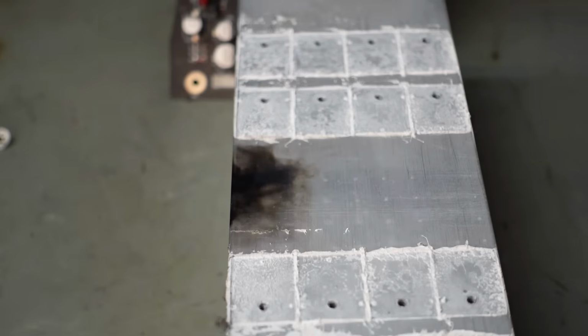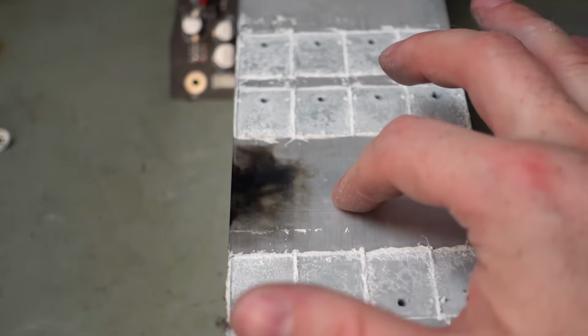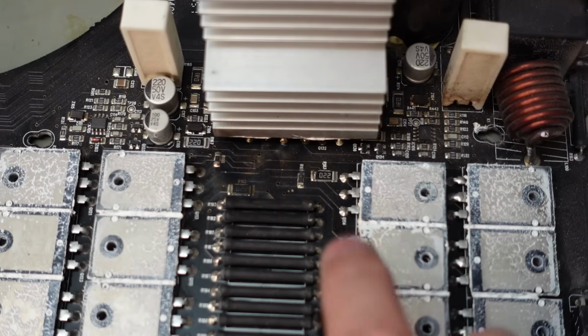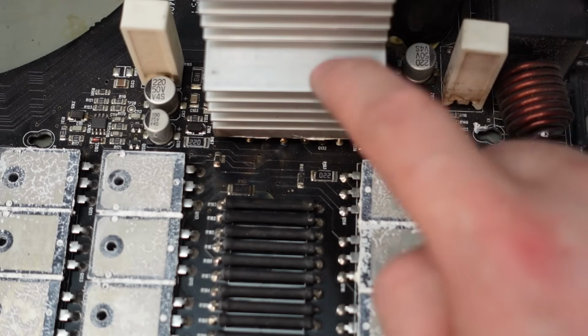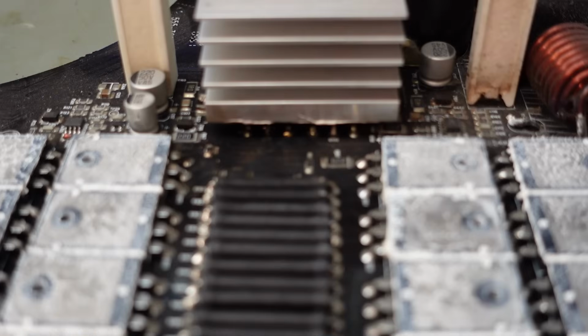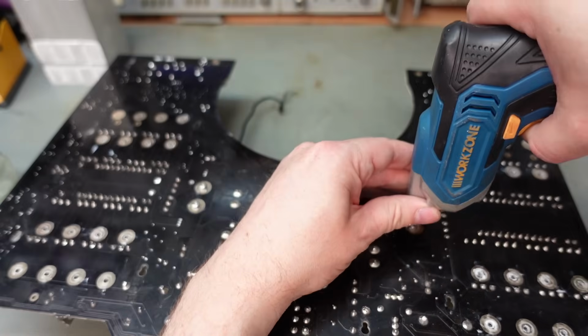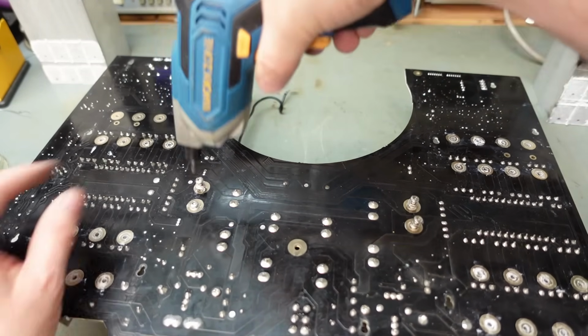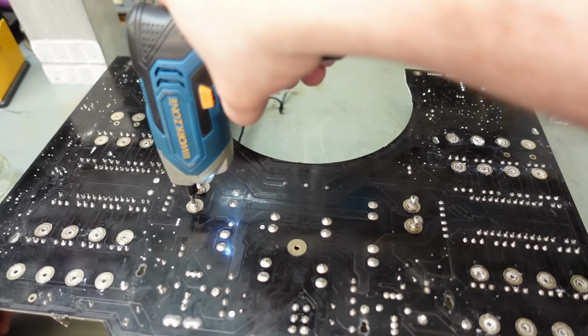Well, I'm pretty sure everyone watching this knows that that's not a good sign. Yeah, it's not just Han Solo who's got a bad feeling about this. Well, you can sort of see where the blasters come from is under this heatsink, and it looks to me like the legs might be blown off that transistor. Well, I don't know if it focuses on these bits under there. It's not just the camera that's out of focus, I think the world underneath here is out of focus really. I'll just take them both off because I might need to read the part numbers off these ones.